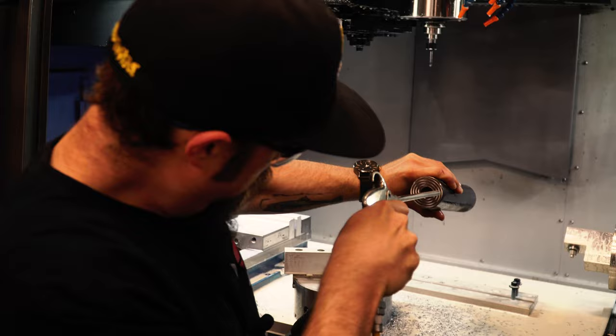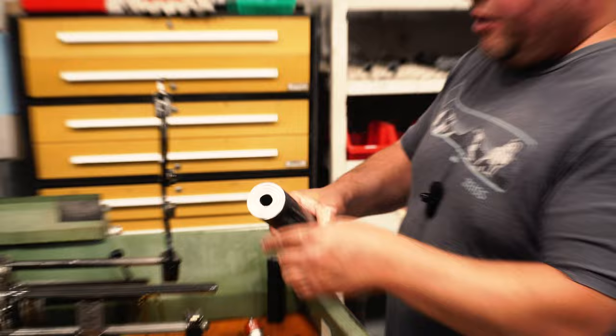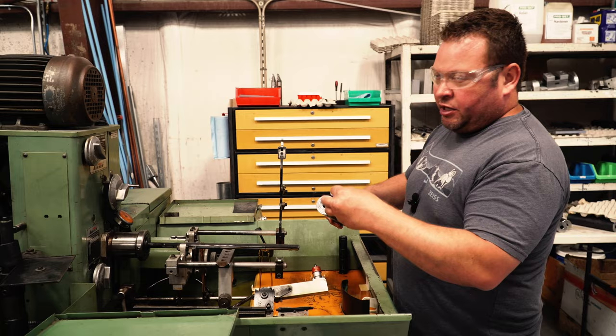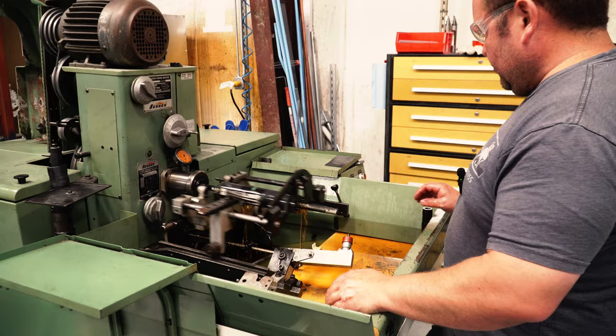She's ready to take this hole to the final diameter. I'm Drew with Altera. We took a raw receiver blank, gun drilled a hole a little bit undersized, and now we're going to put it on this hone. This machine will, as accurately as possible, make the diameter a little bit larger to spec, and also make it round and straight — more so than a reamer or a drill. We're going to use this makeshift shield here to keep from getting oil all over your shirt.